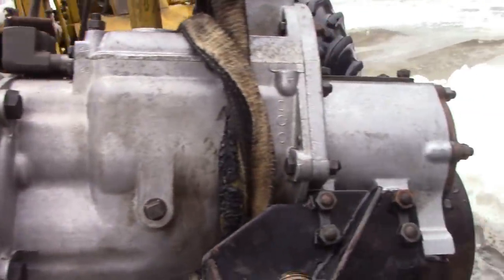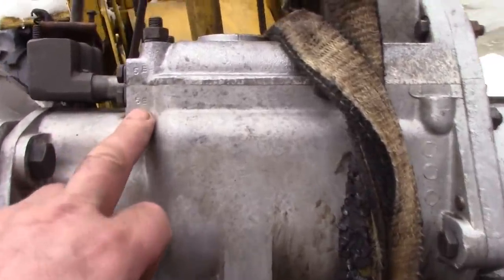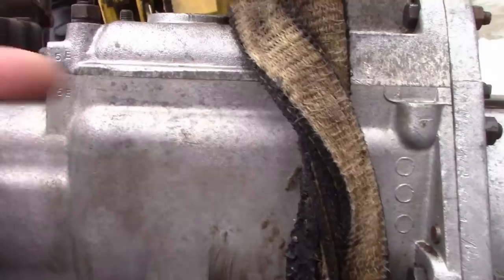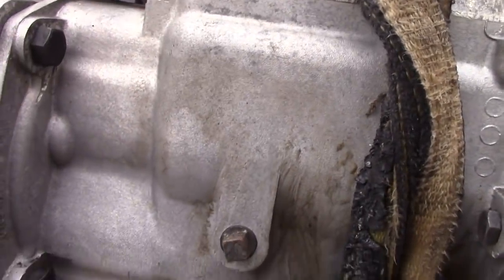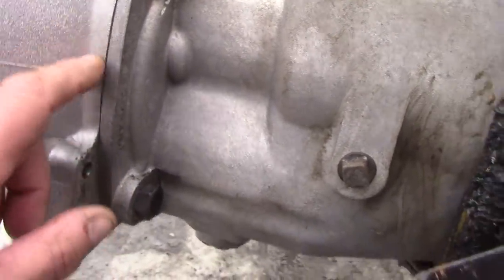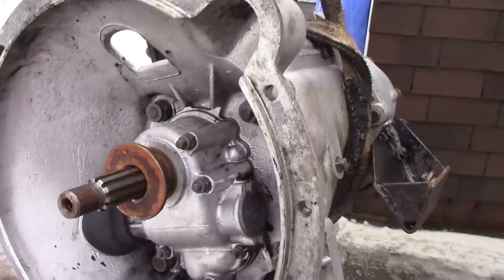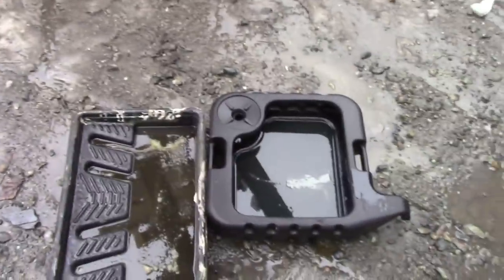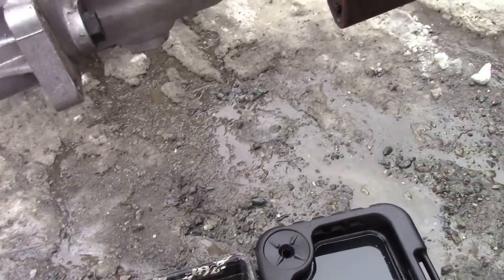Now although we're not going to use these casings, I just wanted to show you something before I strip it down. This casing here is bored together — they bolt it and then bore it together — and you can see it's got 5E on it. That's just a marking. What we're going to do is mark these two together with our own punches, just to show that that casing belongs with that. Once we get inside I'll show you the difference with this housing. We've drained it of oil and it's quite clean, just about all out anyway.